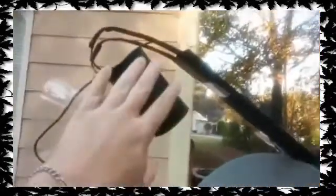It means that you're going to have to turn the unit upside down to be able to use it for terrestrial work. Otherwise, you're going to end up having the parabolic portion facing the ground, and unless you put a cover over the end of your feed horn / antenna, water's going to get in it. So flipping it upside down suddenly turns it into a terrestrial antenna that works really, really well. As it stands right now, I'm getting about 28 dB gain on this antenna, although it is highly directional.